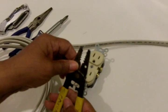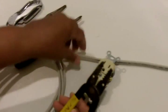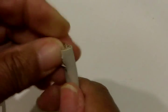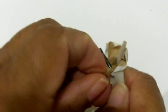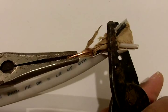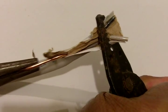We're going to use our wire strippers to cut the wire. There's a little wire cutter edge right here, and that's what we're going to use. I'm going to make our cut so I have something to work with. We're looking for the ground, which is a bare copper wire. You may have to make the cut at the top a little bigger. Use the ground wire to split the jacket. I'm holding the wire at the top with my wire strippers, and with my needle nose pliers I'm just going to rip the side down to give myself a little room.